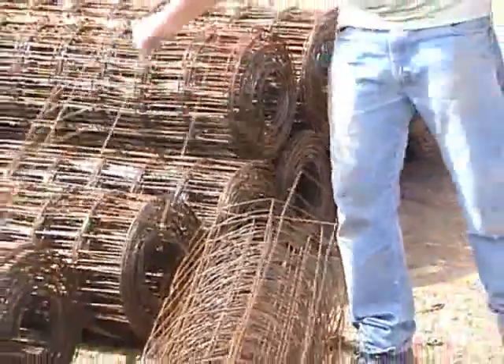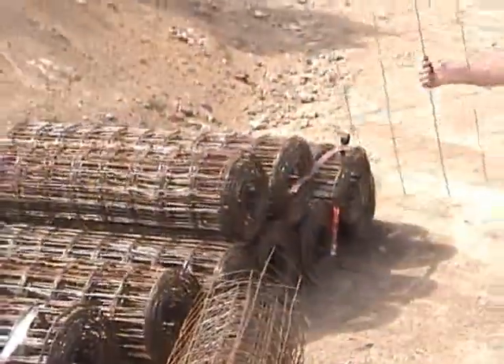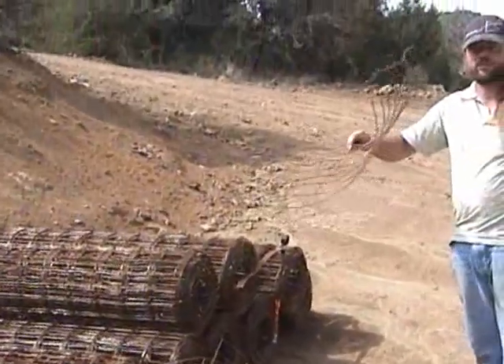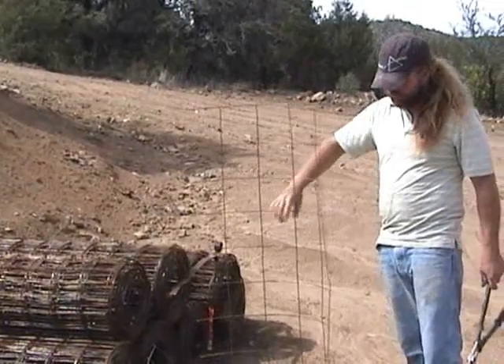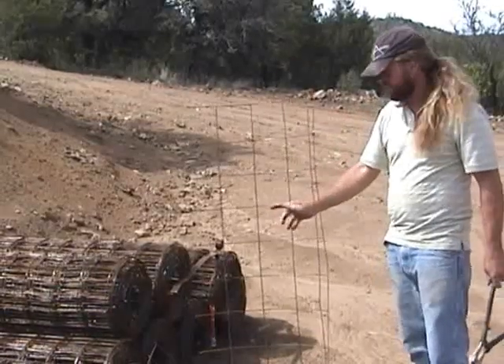And there's a six-inch one. It's actually pretty good if it's curved — it goes through the folder machine if it's curved. So you don't have to flatten them out; the folder machine seems to do better with curved steel than flat steel.